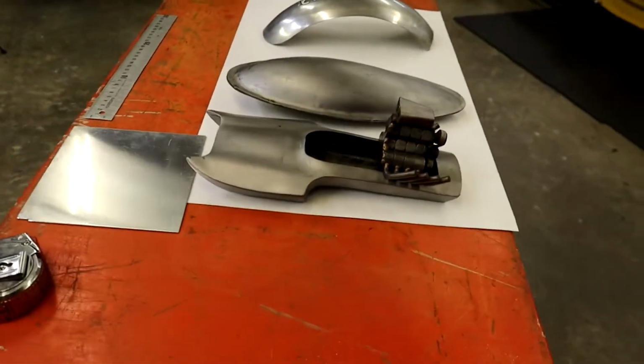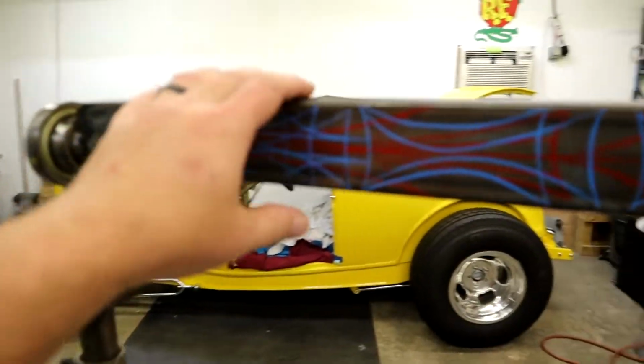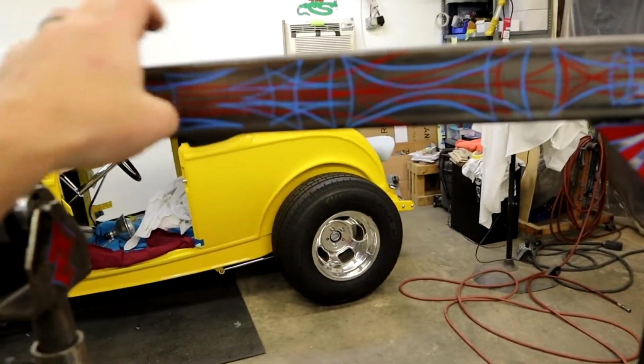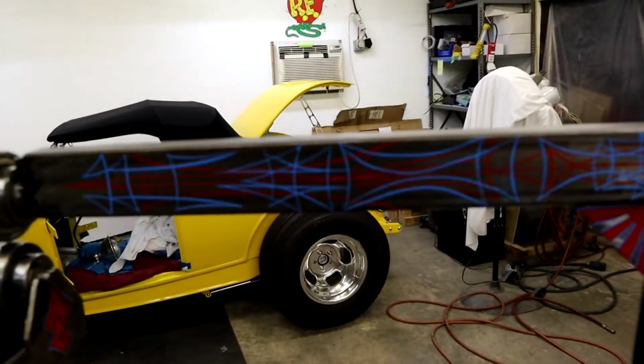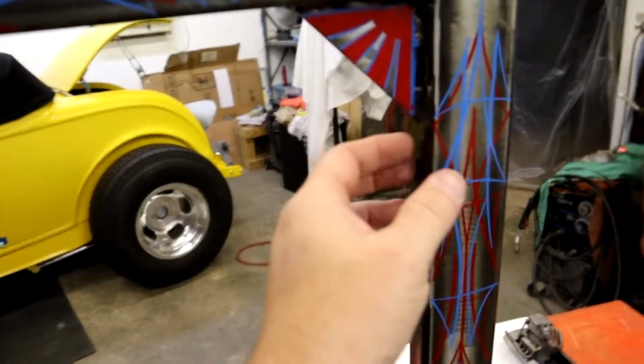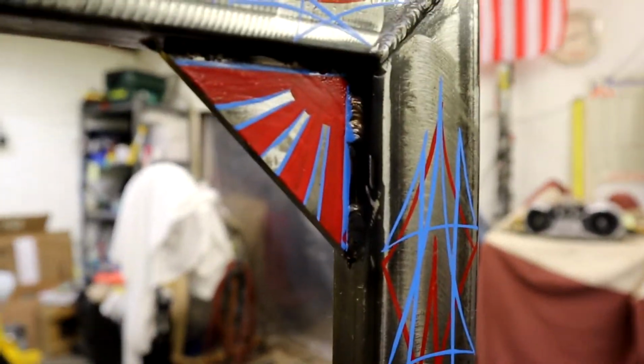Like I said, this one could use some more bracing, but I don't put a lot because if you crank on this thing, it could probably flex. You could drill a hole. I've heard a lot of people drilling holes and putting concrete in it, or building a little gusset on top. All I got are these, I think quarter-inch plate. They're just all TIG'd in there.